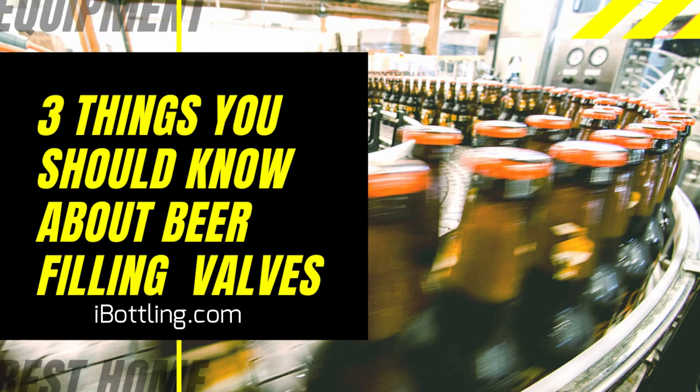Different Cleaning Convenience. The mechanical filling valve — the whole valve is placed in the filling cylinder, so it is immersed in the material and not easy to clean. It will have a stirring effect on the material during operation, which is not conducive to filling. The spring may produce microbial contamination of beer, and there are dead spots for cleaning, so sanitary conditions are not so good. The electronic filling valve is designed with steam cleaning and centering devices, making the residual oxygen and harmful bacteria content meet the storage requirements of beer, overcoming the shortcomings of the mechanical valve spring immersed in wine. It is easy to clean and prevents the wine from being polluted again.